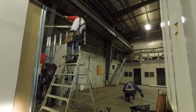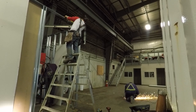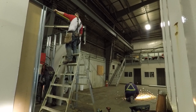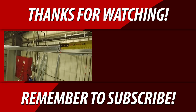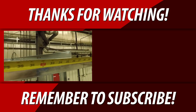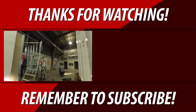You only laser up one side and measure over with your tape measure to the other — you don't laser up both sides. So this is basically the beginning of layout; this is really quick. I'm going to show you guys even more as I'm showing you how to frame and how to get these freestanding walls up. This video right here is how to do the rest of the headers. This is Chris — I'll see you on the next video. Bye for now.